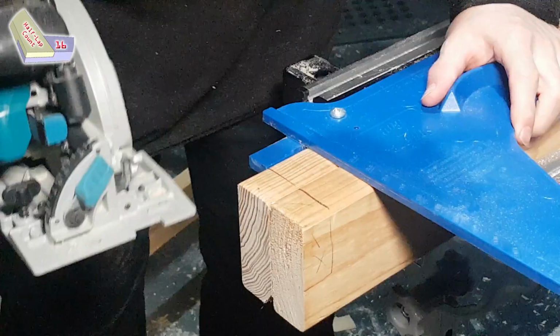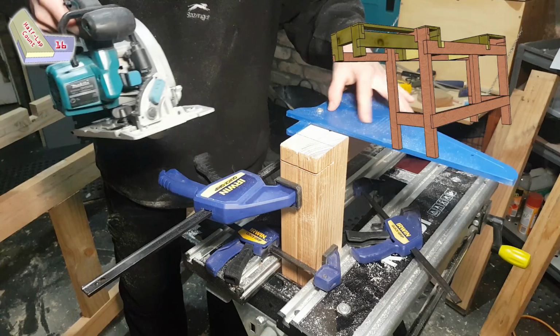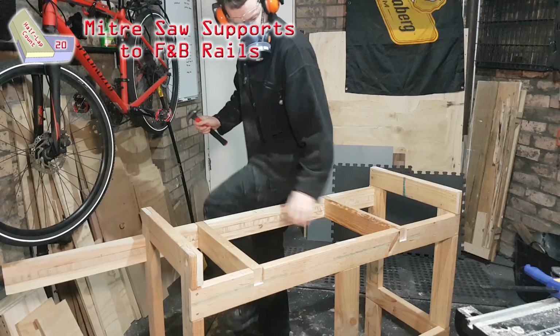Speaking of Dana Designs, aka the Pallet Punter, if you go watch his method of cutting half laps, it is much more logical and sane, where he uses his table saw and bandsaw to make two cuts and gets things done a hell of a lot faster. Sadly, I have neither of those tools, but I did manage to, on some of these cuts, work out how to do it with the circular saw, and it is vastly superior to trenching.